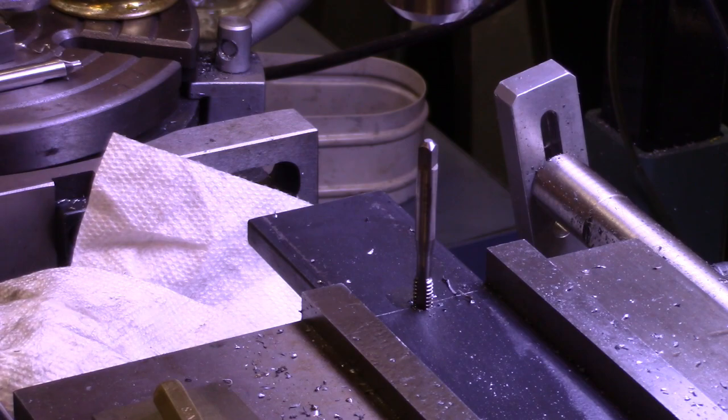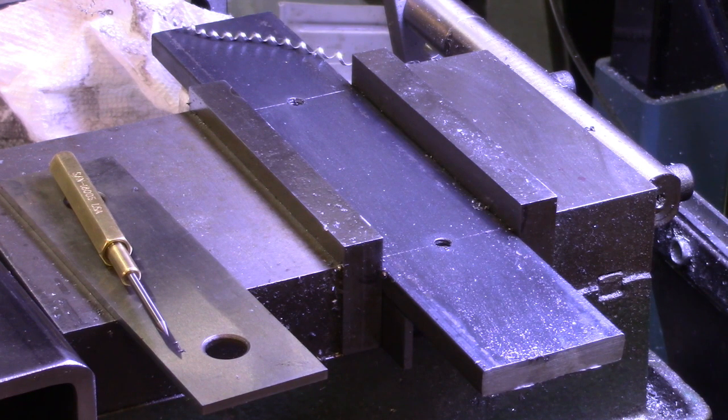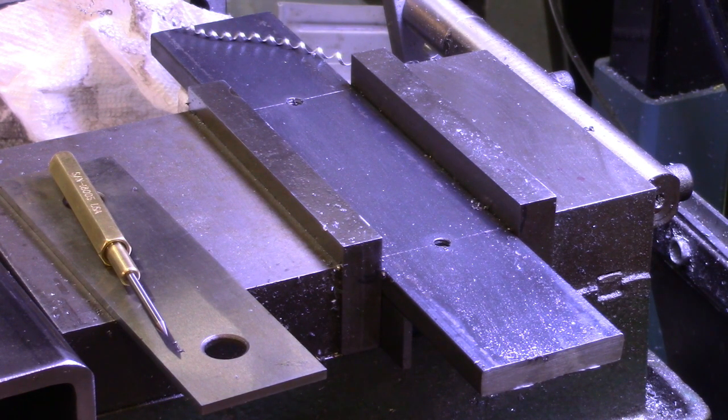And it's mostly through. All right, the holes are drilled and tapped, and that tap went almost all the way through. It didn't take just a few turns with a wrench. If I had been running this thing up around 2,000 RPM, I believe that's what the Tapmatic calls for this size tap, it probably would have sunk in there like a hot knife through butter. But I'm probably too slow to turn the off switch, so that's why I went so slow, about 800 RPM there.